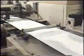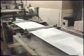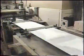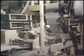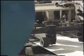After the non-woven enclosed processing, the major part of the disposable diaper is almost finished. Remaining are the accessories designed to increase the stability, including PE film, elastic bands, and free fix tapes. Now, we want to show you the PE film rack. Its structure and function are basically the same as the non-woven rack and is equipped with an edge tracer and connector cutting alarm.